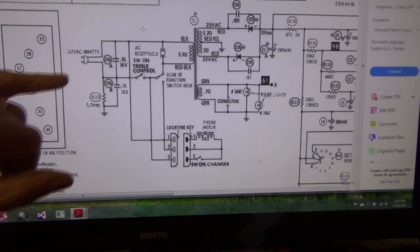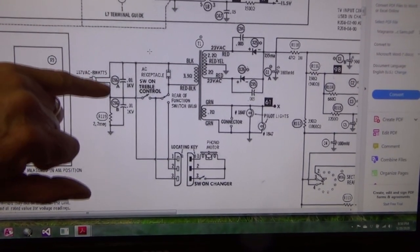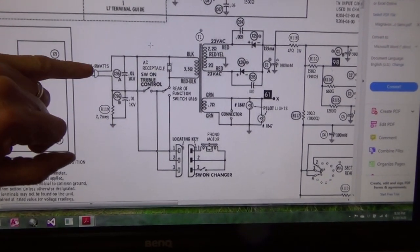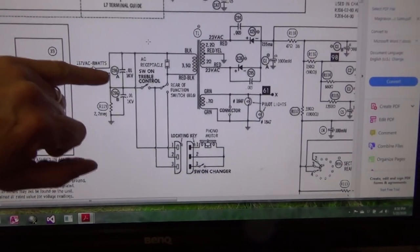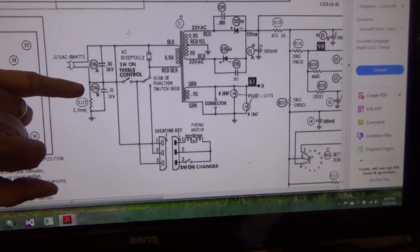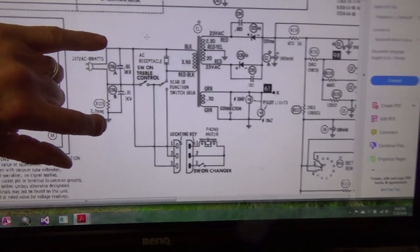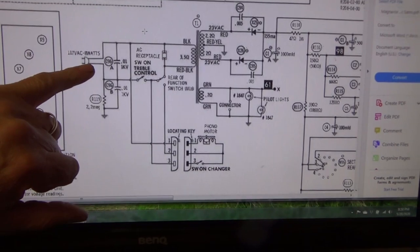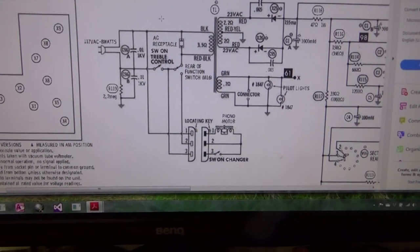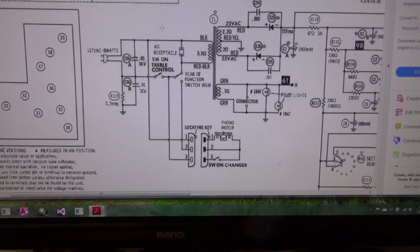So it's a little weird on this power supply. So you come in, you go through this 2.2 meg resistor to ground, and it's unpolarized, right? So this might be the power. Then you have kind of a double capacitor on either side of this. I don't know. It's a little bit strange. I'm going to replace the cord, but I'm going to put on a polarized cord. I notice if I was touching the case, I would get a little bit of a shock. Just really light.